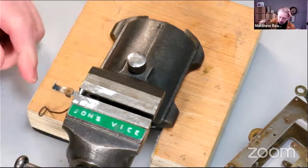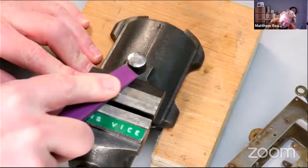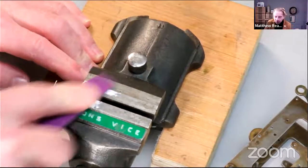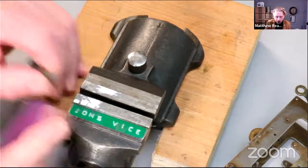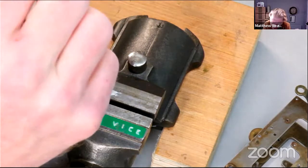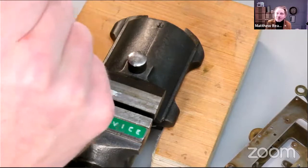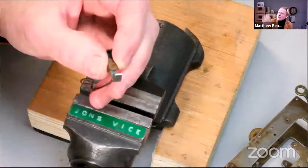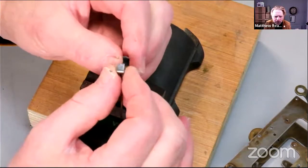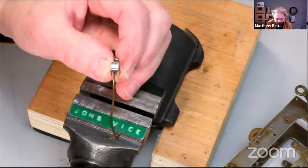Stoning the pallet face flatter, destroying the vise, but here, no, it's a bit of a consumable. Much easier with the vise jaws like that. That's quite smart. Cool. Well, that's a major surprise. But actually, you can get it to focus or not. The impulse face there is actually quite nice and flat. And now it's square or reasonably square where the pallet frame was before, it was off to one side.